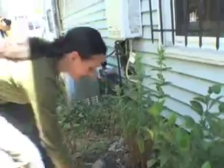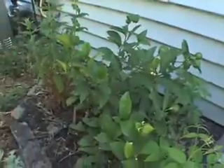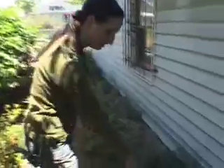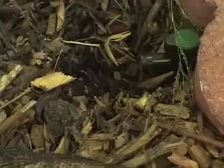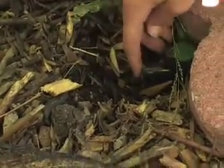You get lint from the laundry landing onto the mulch. This is a lemon tree and there's a ring dug around it filled with wood chips and mulch, so the gray water lands onto the mulch and soaks down into the ground. There's another emitter going to the kiwi. Usually one of the challenges with gravity gray water is it's hard to really spread it out to get it to the plants, but with this washer system you can get a lot of flexibility in how you're spreading it out.